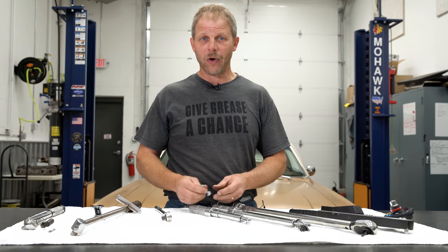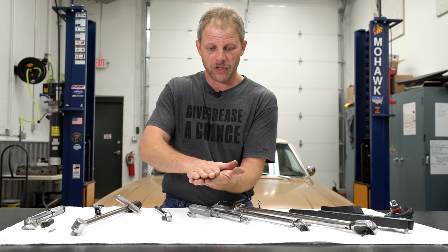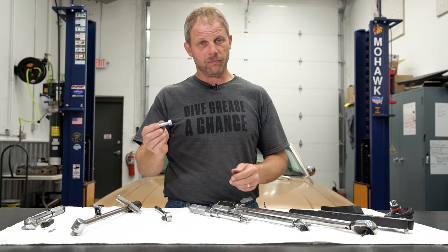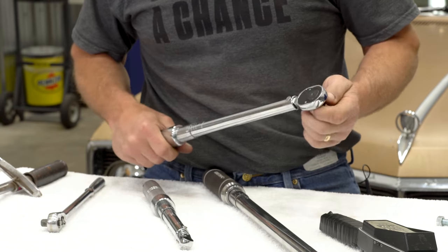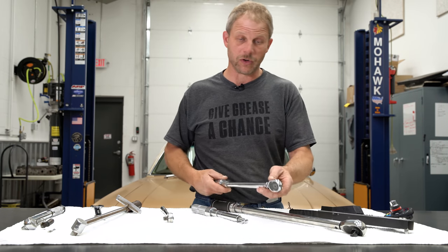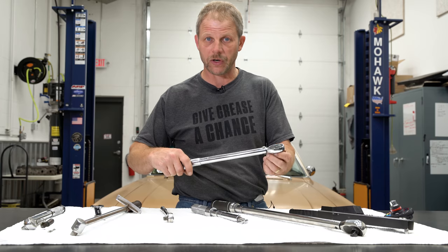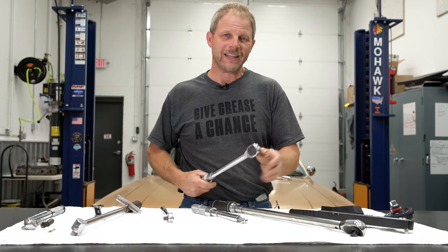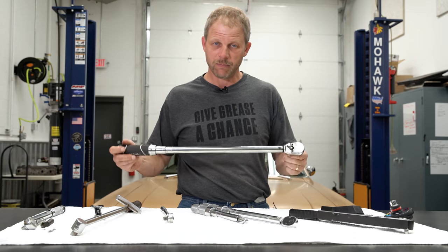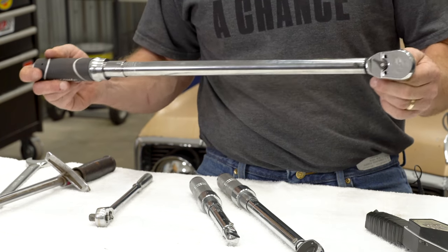The function of bolts and torque wrenches is all about clamping something together and holding it from coming apart — or in the case of a wheel, holding it from rotating. Fastener size and all that stuff makes a difference, so use what the manufacturer asks you to use and you'll be fine. Torque wrenches are typically used for clockwise right-handed application of torque, but they are also reversible and go in the left-hand direction as well. So if you have a left-handed threaded bolt, you can torque it too. However, these are torque wrenches, not breaker bars. Do yourself a favor — buy a breaker bar to break away bolts or nuts that are tight. Do not use your precision piece of equipment as a hammer to break parts away.